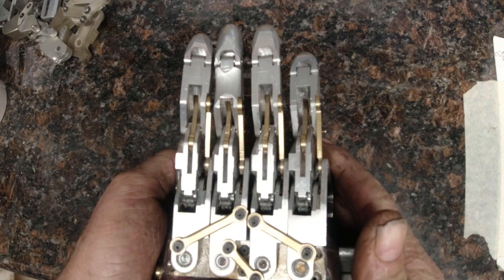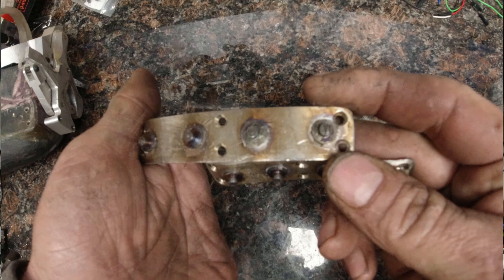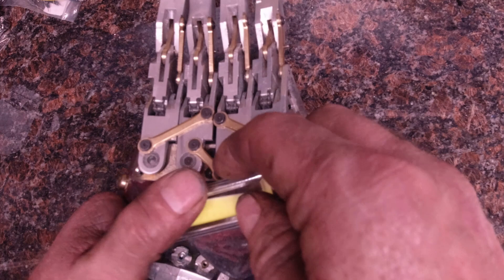Now that I had the fingers designed and prototyped, I had to figure out a way to mount them to the socket. I decided I wanted to retain the splay function from the current hand, as it turned out to be way more useful than I ever thought it would be. I fabricated a couple of stainless steel strips and machine pins that the bearings and metacarpal bases are able to rotate around. Those plates are held in place by 12 T-nuts and 4-40 cap screws — six on the top, six on the bottom — making it pretty easy to install and remove the fingers from the socket. The splay linkage is still located on the palm and will be driven by the lateral motion of the wrist, just like before. New to this hand, I'm mounting two strips of LEDs to the palm of the socket so that I'll have a flashlight built into the hand — should be a pretty useful addition, or it might just end up being a novelty. But I won't know until I get it going and really start using it.